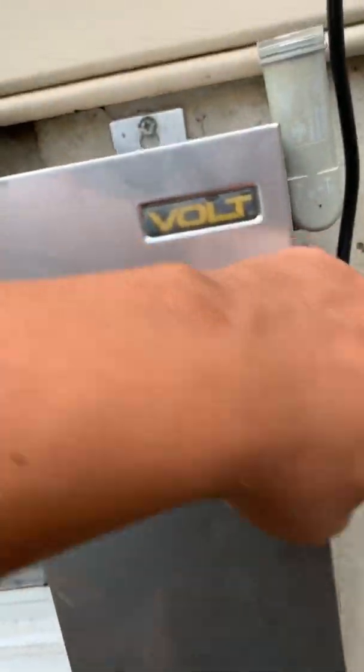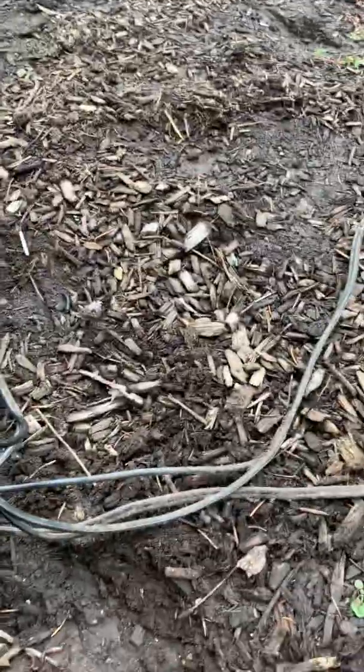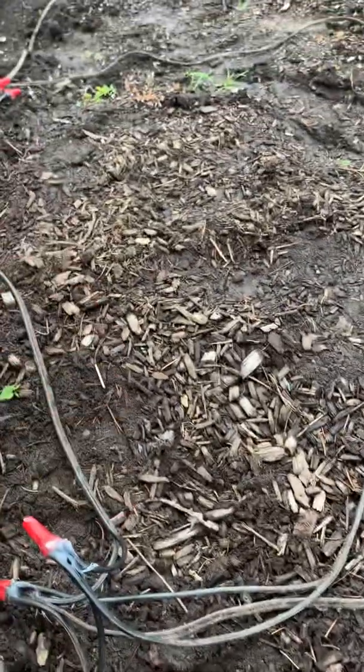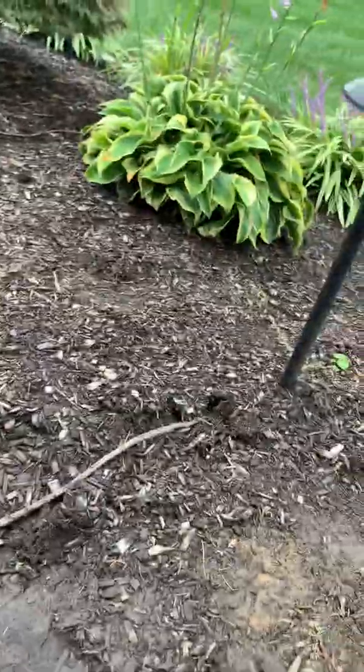So I'll take a quick walk out front and show you what I ended up having to do to narrow it down. Up here I have these all wired up. They come through here from the other side of the fence. I had to pull them all up through the ground and had to eliminate the front side over here. I re-siliconed these — I add some silicone in, put the wires in, tighten them all up, in case I ever have to disassemble them to check which lights may be an issue in the future. If I used hot glue I wouldn't be able to snip the wires and re-strip them. So I eliminated the front over here and just tied power into these two which go down to the front.